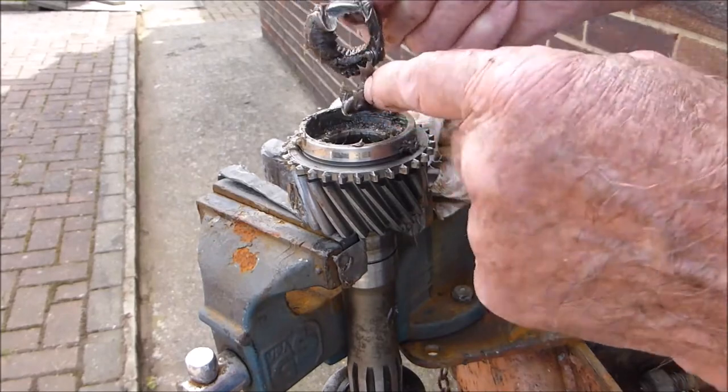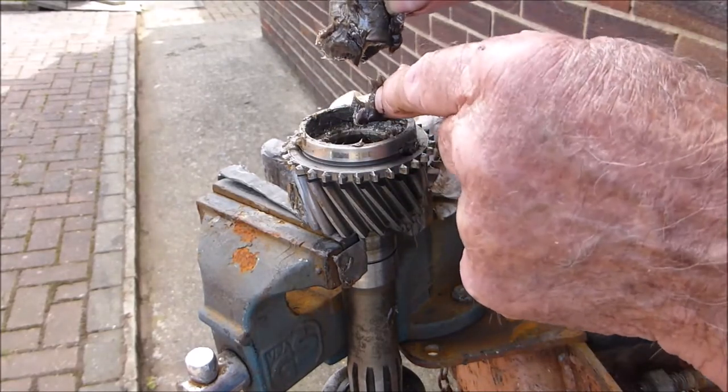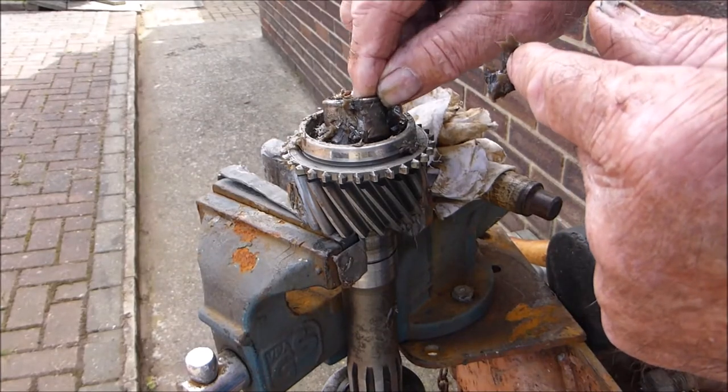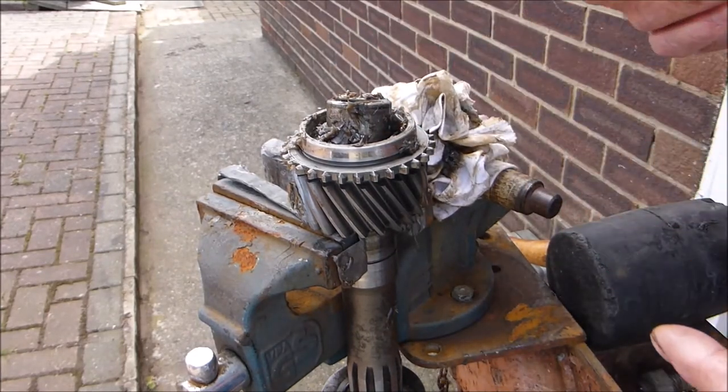So it just used hydraulics — you can see where it's pushed on the bottom. By pushing through the center it pushes the bearing out from the blind hole without damaging the bearing at all. A bit messy but it works.